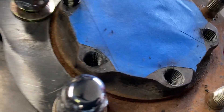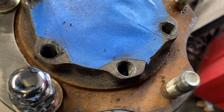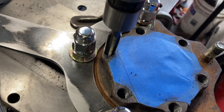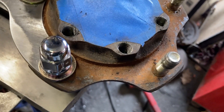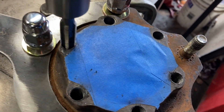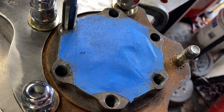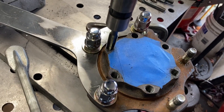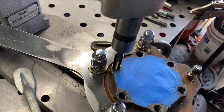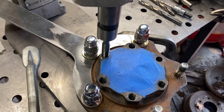That's it - takes less than a minute per hole and they're nice and straight with no broken taps. A lot of people go nuts over tap magic and different lubes, but this cast material taps so easy that in my opinion it's not worth the mess, especially since I'm trying to keep the tape on to keep shavings out of my bearings. I'm just doing it dry and it's cutting just fine. These will be 18 holes with this one tap and it still goes through like butter.